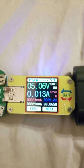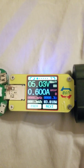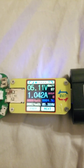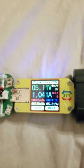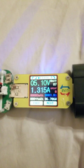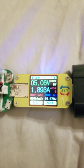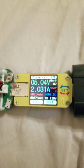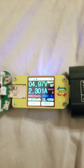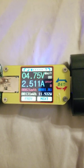Right now I've got it plugged into the one-amp port. Let's put a draw on it — that's about a half amp. Pulling a full one amp out of the one-amp port — good. Let's see how far up it can go. It's 1.8, 1.9 — wow, we can pull double out of the one-amp port. That's two and a half amps, more than enough to charge devices.